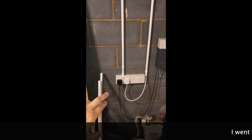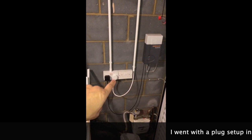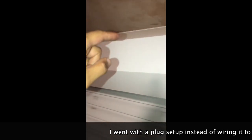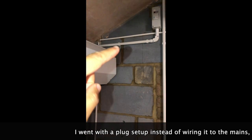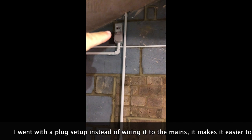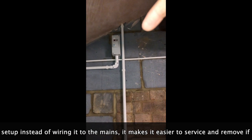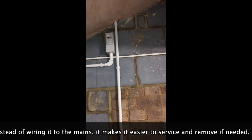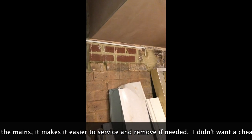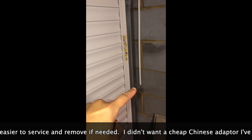So this is my setup — I've gone with the plug option, connecting the two-core wire into a plug socket. That's housed in trunking running along the top of my garage. The live and neutral wires go into the transformer in the enclosure. In the top I've gone for a 12-volt setup, with the 0 and 12 connections running through thinner trunking into the chime.